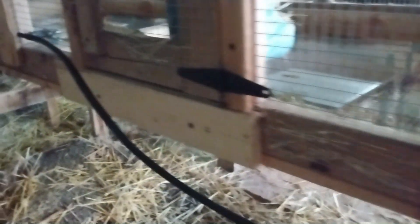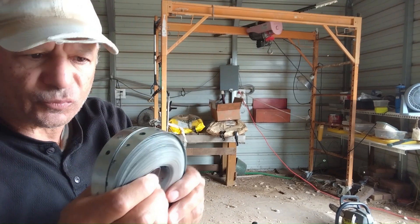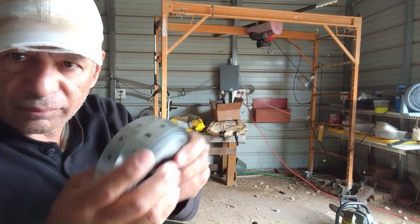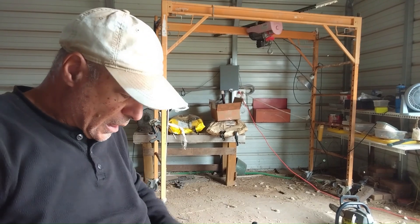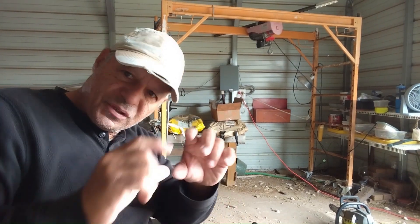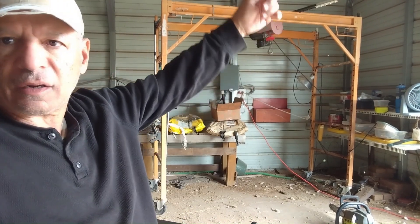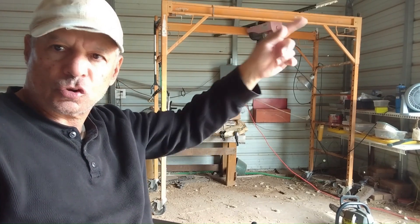Here is the system for the first two cages — the first one and the second one, and it will continue from here. Now I have this metal tape, we call it plumber tape. I'm cutting it into small pieces and shaping it to screw it down to hold the tube in place so it will not be moving or swinging. It will not be in the way of the doors when they open, because the tube is going under the doors and coming back above the doors to return to the bucket.